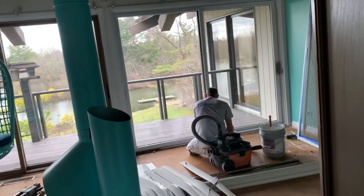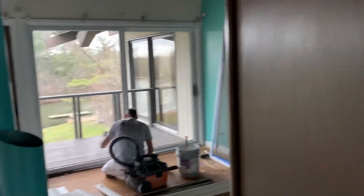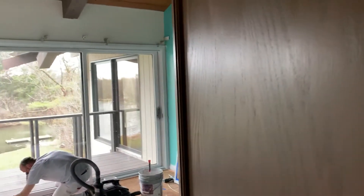Most of the stuff that we're doing here is polyurethane — you can kind of see from the shine and staining. We'll use the cover stain because we didn't want any kind of tannin or bleed-through of oil, or yellowing coming through, and the cover stain will stop that.